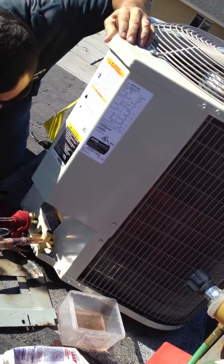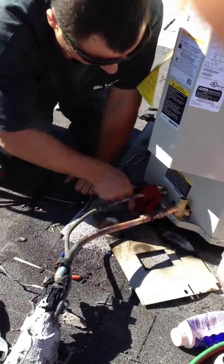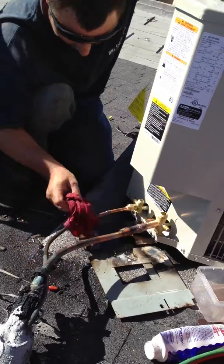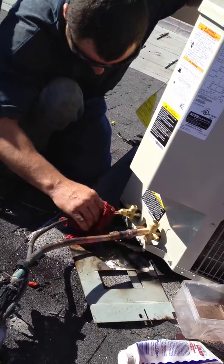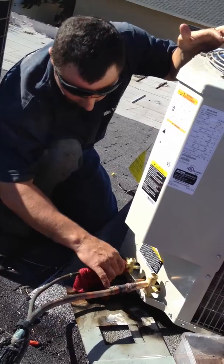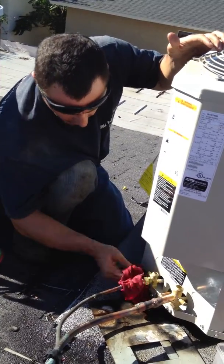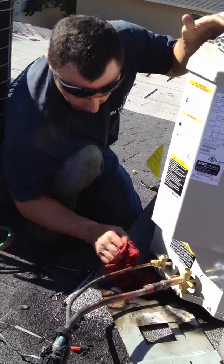Let's spray here, let's cool it down. He's trying to cool it off, and then he's going to check it with a mirror to see the bottom part of the pipe, to see if it got sealed. We have to make sure — because this king valve has a little seal inside — that it's not overheated. If you apply too much heat here, the heat transfers; even though this is brass, the heat goes through because copper heats up faster than brass. But that's what we always try to do: heat it and braze as fast as possible, and then cool down really fast.